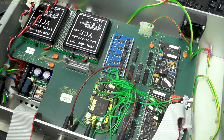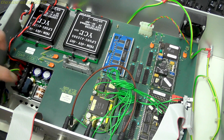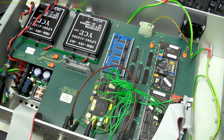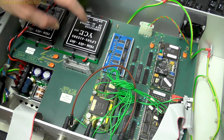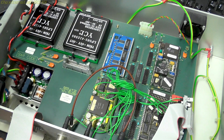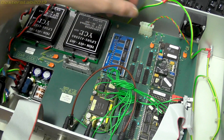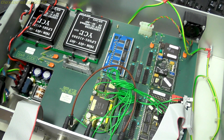We're a little bit further forward — I've installed the mains power supply down in the base, the two DC-DC converters are mounted and soldered in up here, and all the board is back in place. I've just powered it on and it all turns on just fine. So what I need to do now is finish connecting up all the wires and give it a test on the paint box.